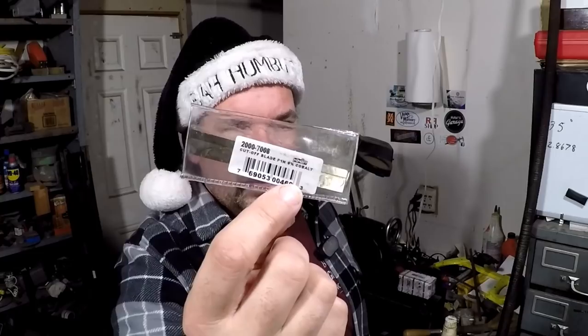At the same time I ordered that, I ordered another parting tool. This one's really thin — maybe about a sixteenth of an inch or so. I only had one before and it had a curved top, and the tool block doesn't seem to like that one. This one has kind of a T-shaped top — it's hollow ground on the sides a little bit but flat on top.